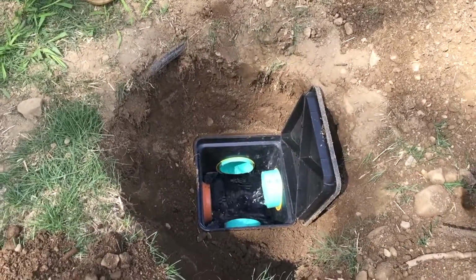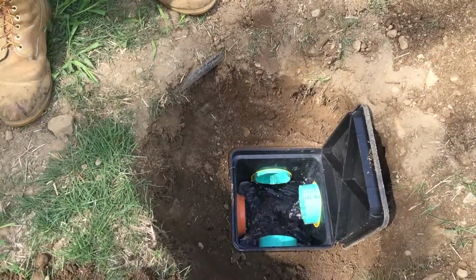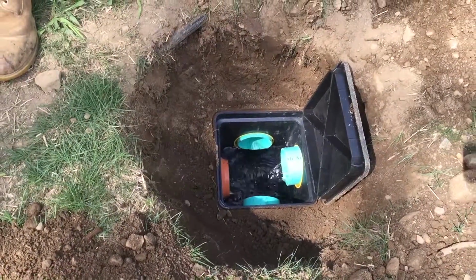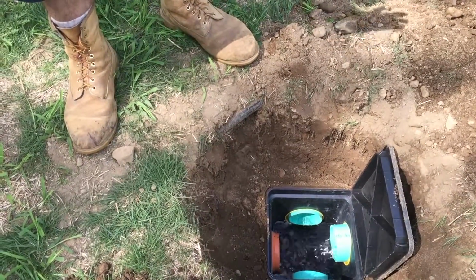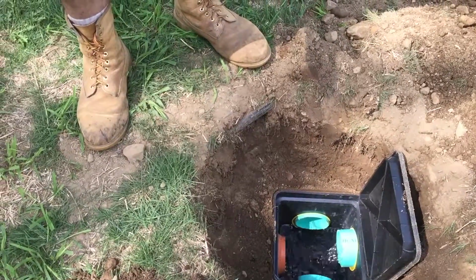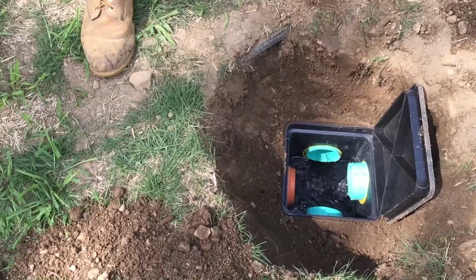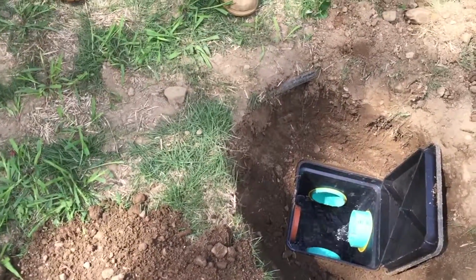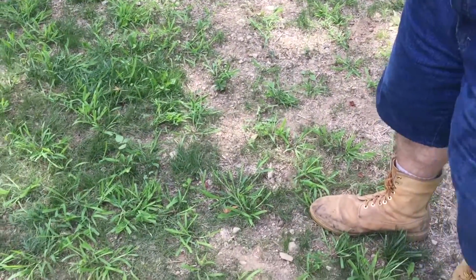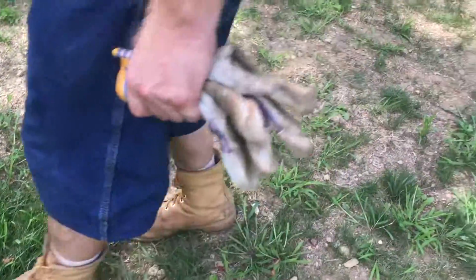So, what do you think that is? Is that part of the sprinkler system? This is the sprinkler system. Now, technically, sprinklers are supposed to be 10 feet from any part of a septic system. You just got to be careful with a sprinkler system because if they pop a leak, they can flood out your septic system. And so you should have some type of valve gauge inside the house that shows that the thing's leaking dramatically because you want to know that. We've had people fill their basements with... We just get king-size puddles. Yeah, you want a puddle. A puddle is better, but because you have a septic system here, it's not going to form a puddle. It's going to flood your system. That's why sprinklers and septic systems don't really get along.